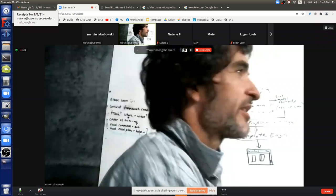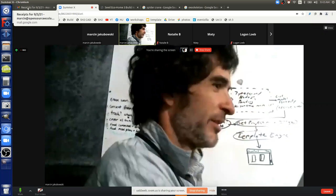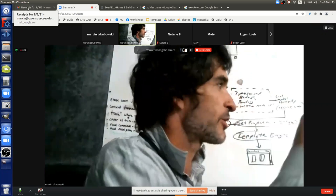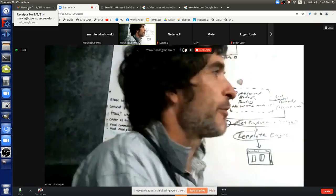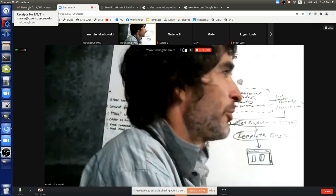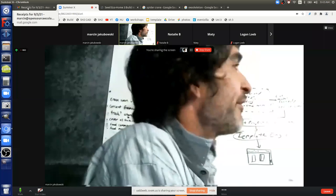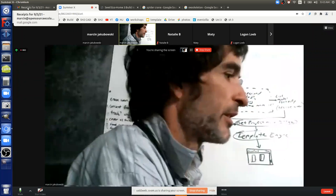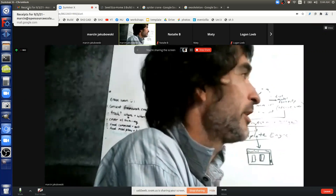That lets us have a chance to revisit the squaring procedure, because, like we talked about, the order of build matters. That gets very important in things like how you square up a foundation. So let's do this. On the pad there, we have one straight edge. We'll go basically 16 feet south, a little more than 16, to where it's level. If you're looking at it from the front, from the south to the north, the left-hand side is one straight edge. We can start there. We've got one piece of wood, it's 60. We already pre-cut everything.